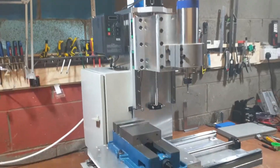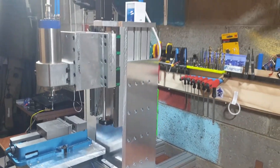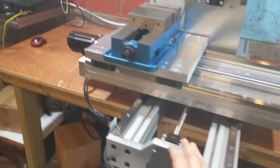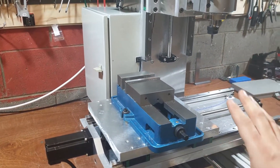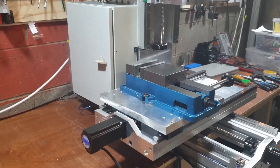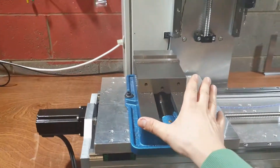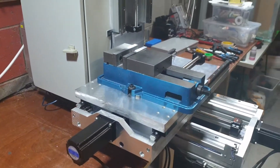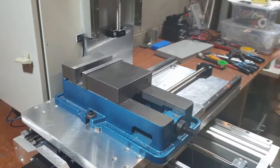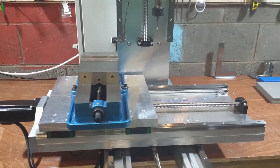This is my new project, my custom-made CNC milling machine. It's not completely finished, but I'm just gonna talk a little bit about this. This is mostly my design. I saw very similar designs, but this is what I designed for my needs, for what I'm going to do. The build size is not huge, but the most important thing is that this machine is very rigid. The build volume is 180mm on the Y-axis, 330mm on the X-axis, and 200mm on the Z-axis.